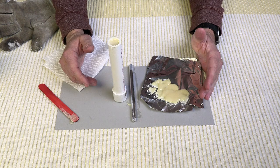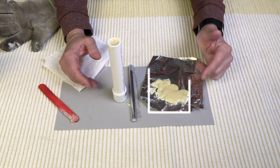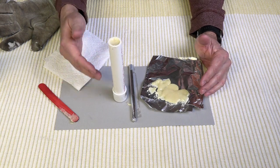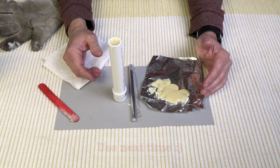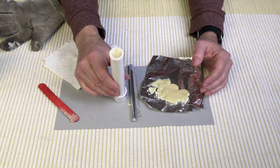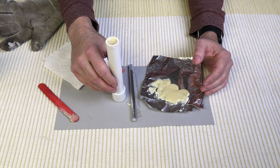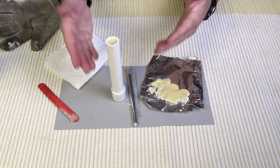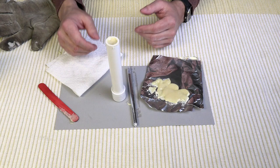I started out with 100 grams, then added 25 grams of leftover fuel from a previous casting. I have about 25 grams left — it is a little bit easier to cast more than you need, so you're not spending a lot of time scraping the pan out, and it pours quickly while it's really hot. I filled the tube up and it's a little over full. I usually like to leave about three-quarters of an inch because when I push the coring tool down it's almost going to ooze out, making a little mess — but paper towels are cheap.